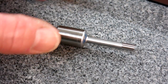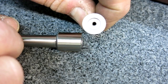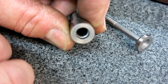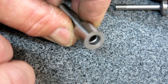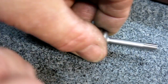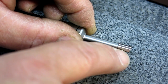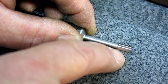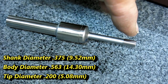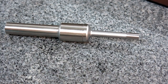This tip diameter here — let me separate this and there's the end. I ground the end of that. I actually lapped that just a teeny bit just to see what it looked like. There's the grind on the end of that. We're going to lap those carefully together now. At the tip here I've left a couple tenths on there — we're going to lap that as well to a real precision diameter, 200 thousandths. So we got to make a little lap, a little plug, and a couple of other little things, and then we can try this thing out and see how it works. Pretty cool.